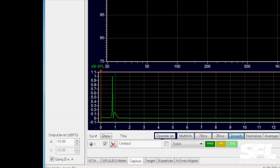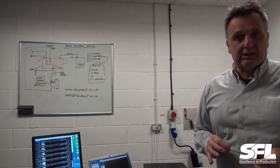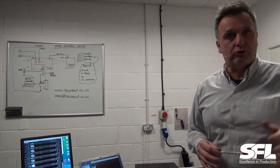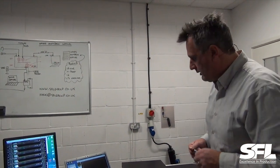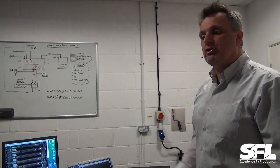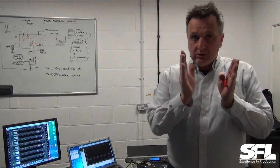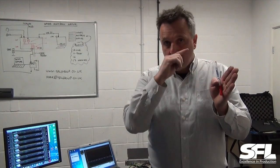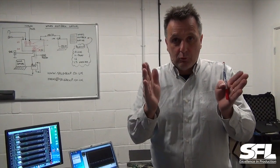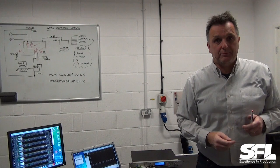Along this scale we have milliseconds. The console latency — the time it takes to get through the Midas M32 — is just under one millisecond. Most consoles you measure will have that kind of latency; some will be slower. This console is running at 48k — if you run at 96k you effectively halve the latency. One millisecond is pretty good; in acoustics it's about 0.9 milliseconds per foot. So if I step one foot away, the sound you hear is delayed by another millisecond.